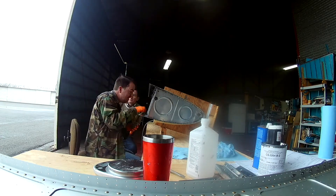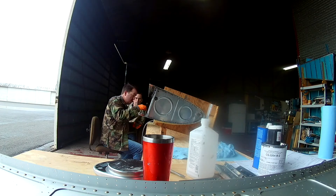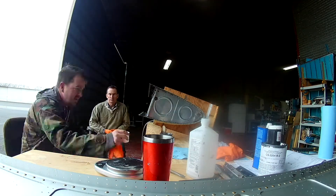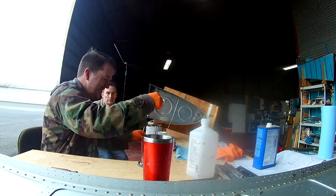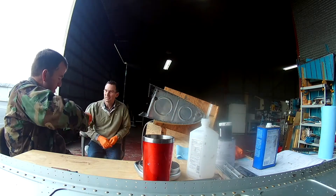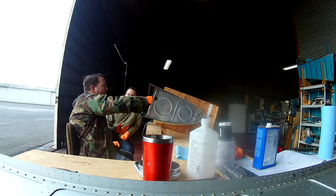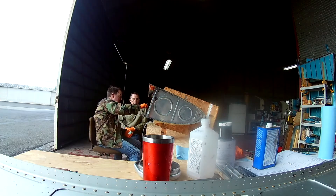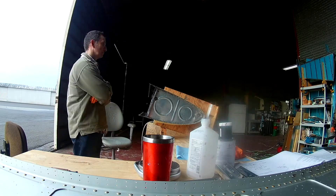There's not a lot of wiggle room. You can plant one side — say the top or the bottom edge — in place, but then you have to slide the other edge down into place and on top of the ribs as well. Vans makes a note of that in the instructions: this will act like a squeegee and will push the sealant around. So we decided the best thing would be to have the bottom side be where you initially place the flange of the baffle, then smear it across the top. The reason for that is the large drain holes — or pass-through holes — are on the bottom of the tank, and we don't want to be squeegeeing any excess sealant into those areas. It also contains the drain on the edge, and we didn't want any chance of that stuff plugging up the drain.